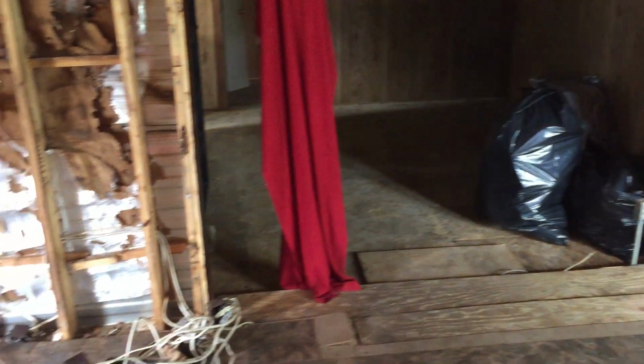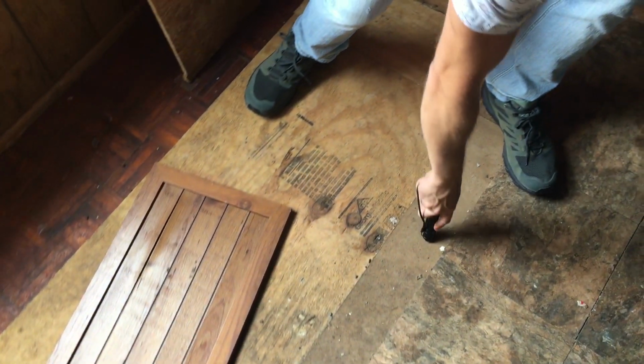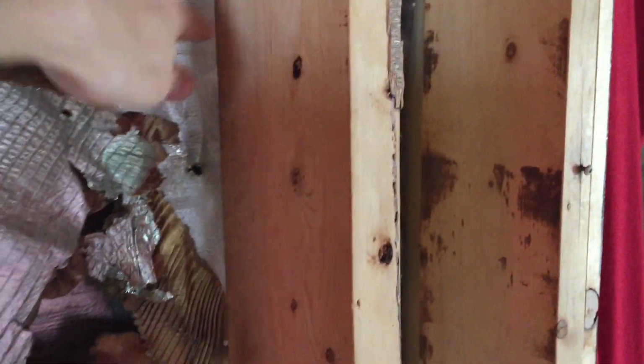I mean, you can tell they put the 3/4 inch, this is the original floor and the plywood. A little bit of pad for these sticky tiles, which I don't know when the sticky tiles were put on, but they seem to be in decent shape. All these plugs just everywhere. Interesting to really see just the anatomy of a mobile home. And then the insulation, which this would have been an exterior wall. We have 2x6s. And then the aluminum.